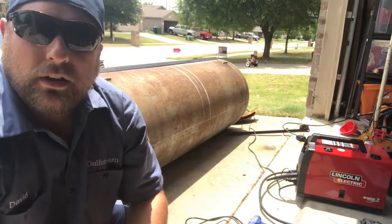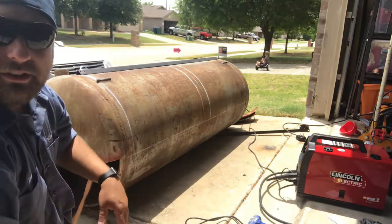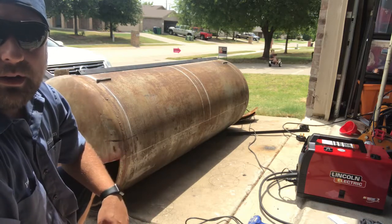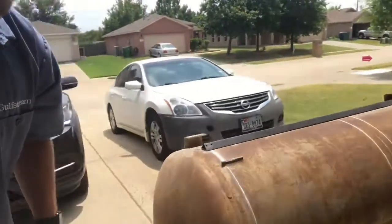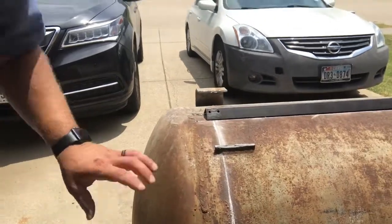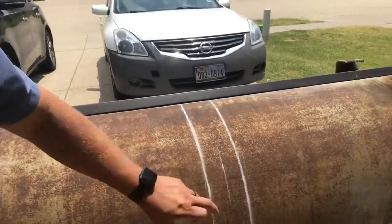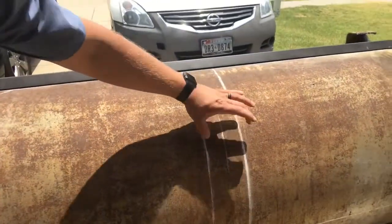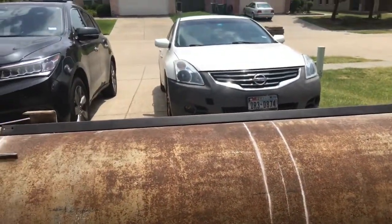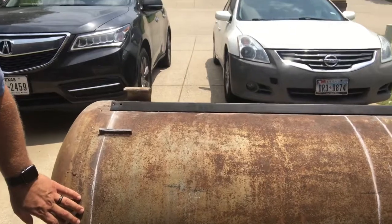Another day here on the smoker. I got the doors all traced out — I did not video that. Basically I went two inches over from the weld on the tank on both sides, then measured the center point and made it four inches wide. There's door one and door two. So today I want to at least make the marks because my tank's sitting outside.